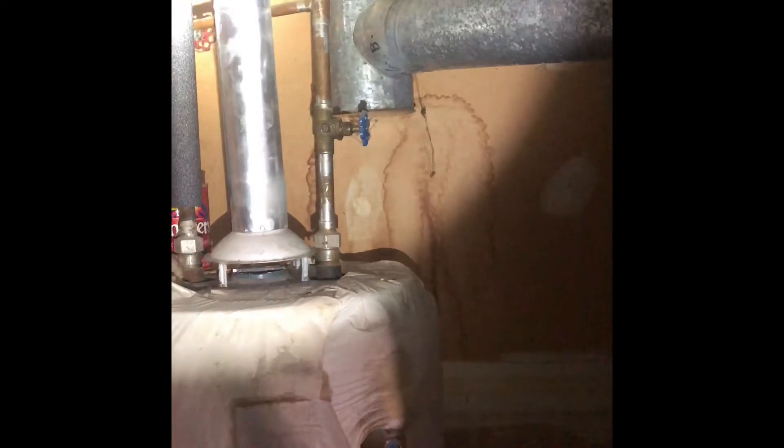Right now the filter system is not ideal. For the flue pipe, we're going to do a four-inch out of the top of the furnace and a new six-inch by three-inch by four-inch swivel tee. Then we'll bring two feet of three-inch and one three-inch elbow to get rid of that aluminum stuff that's not up to code right there.